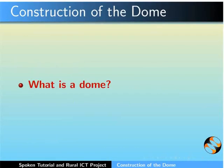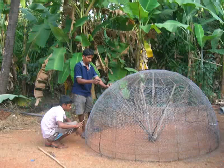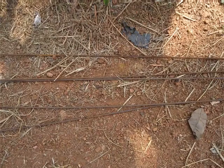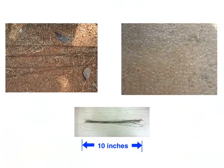So what is a dome? A dome is an arch-like structure placed on the digester tank where the biogas is collected. Construction of the dome is a very interesting and important procedure. Items used for construction are steel rods, chicken mesh, and steel wire. Detailed specifications of these are mentioned in the tutorial on material required.